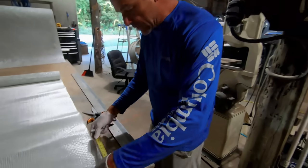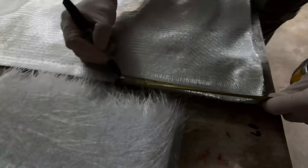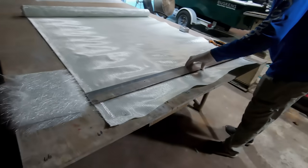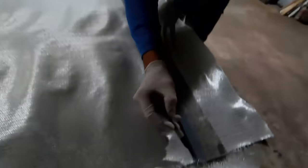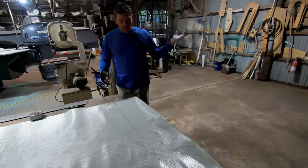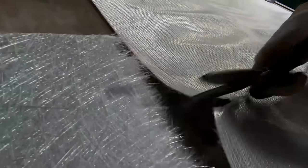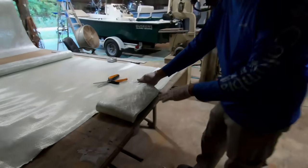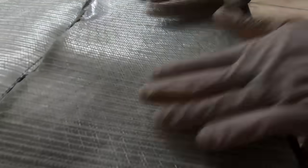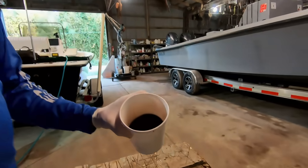What we do is use a little Sharpie to mark nine inches and pre-cut our glass. Planning your work ahead is a big part of doing good fiberglass work — it's okay to pre-cut your glass even before you resin coat. The 1708 biaxial basically has two layers: a CSM or chop strand mat on the back side, and then the woven 45-degree material on the front side.